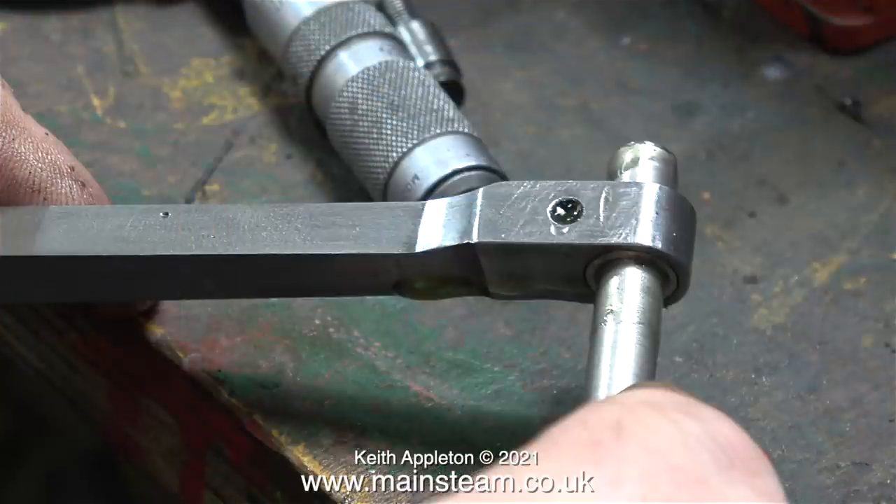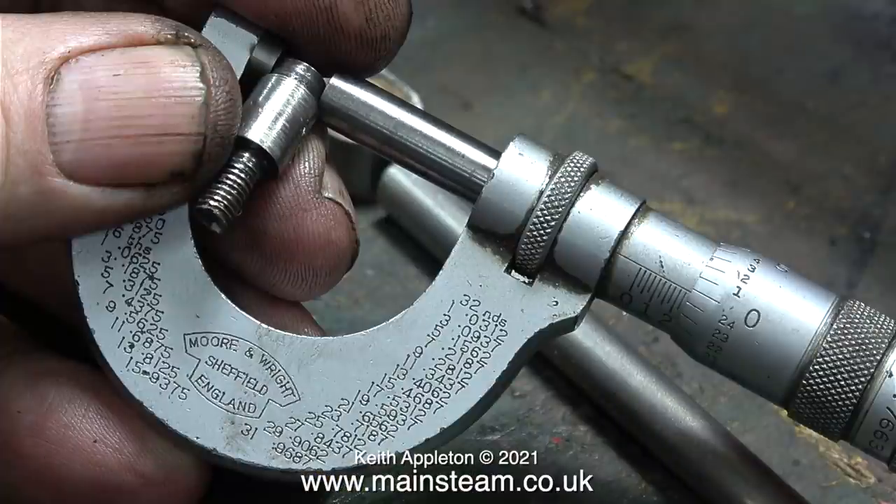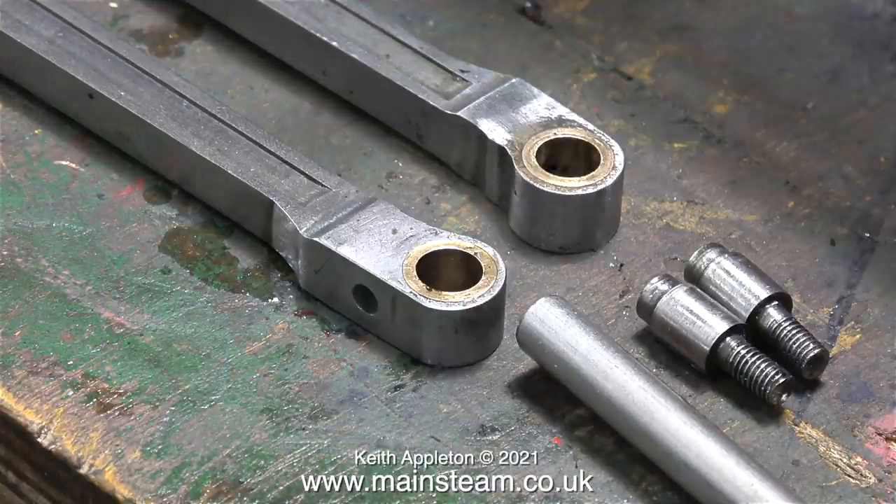When I try this piece of steel in the small end with plenty of lubrication, it's actually quite a good fit — I was very surprised. The small part being measured is a quarter of an inch in diameter and it's more or less bang on; this is the bit that fits into the hole in the cross head. I checked both sides and both of the pins were undersized, so I really do think they were turned that way — I can't see them wearing in such a linear manner.